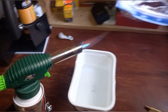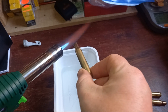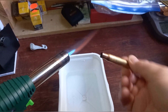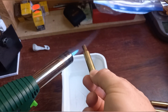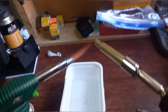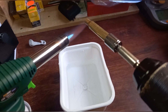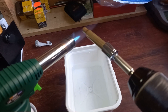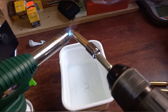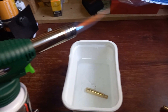Okay, so the flame is on — you'll see the blue flame, that's where we're aiming. What you want to do is put your brass at a pretty steep angle, maybe 45 to 50 degrees. You don't want heat coming straight into the case; you just want it concentrated right there at the shoulder. I've already loaded up one case here into the hand drill. I'll just quickly show you how to gauge when it's done — I'll concentrate the heat source right there at the point of the case. And that's it — see the flame changed color there? That's typically what you want to see.